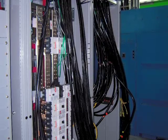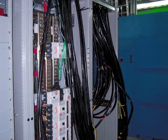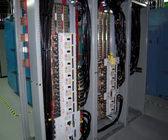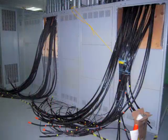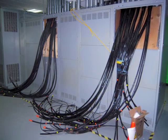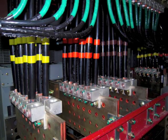Last but not least was the installation of tens of thousands of feet of electrical cable in all sizes. Each of the cables feeding power to and taking power from each UPS module had to be the exact same length regardless of where each module sat physically. This added an additional level of complexity to the installation, as we had to factor in additional modules that will need to be installed in the future to protect our growth.